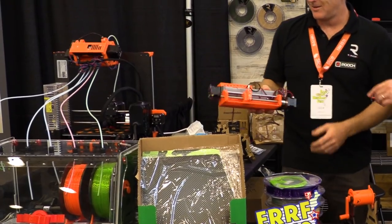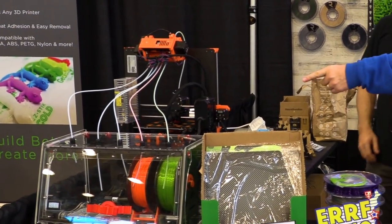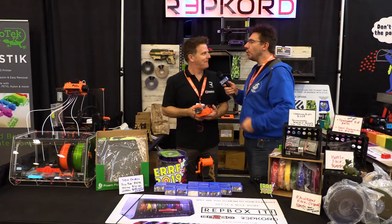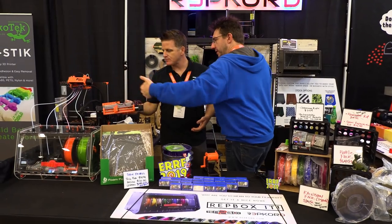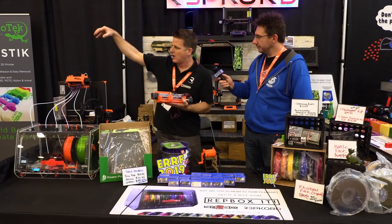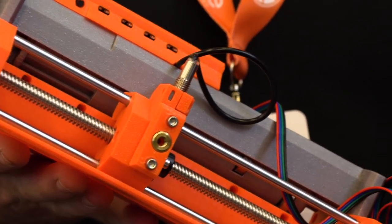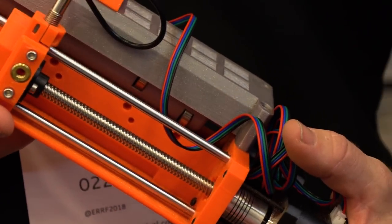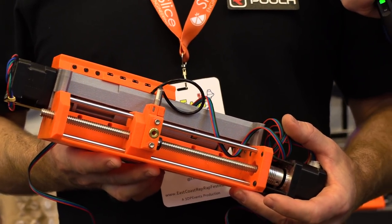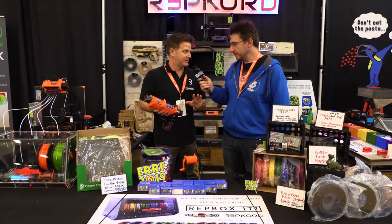So we're talking about taking this MMU2 part right here and attaching it to the RepBox. And now we just have one Bowden tube going from this to the MK3 or MK3S. As far as the MK3 knows, it's the same unit — you just adjust the firmware to tell it where to index a little further than the more compact original. You put it on the wall right above, feed straight down into it, and you're good to go. I'm really shooting for end of the year on this one — maybe a Christmas gift to the community. I haven't tested it enough yet, so I want to make sure it's dialed in before I release it.